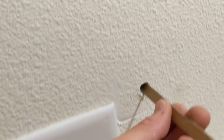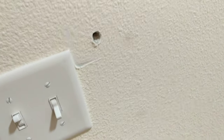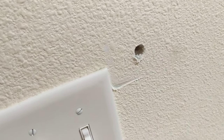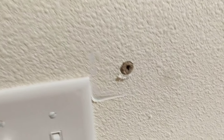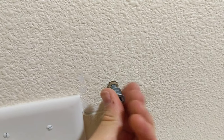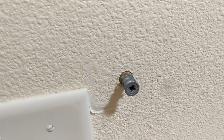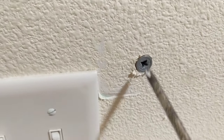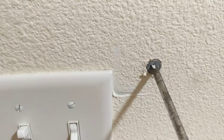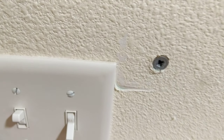So I took a piece of cardboard and measured the distance from the edge of the lip of the hole to the other side of the wall. I'm going to roll up some cardboard really tight and try to screw that in there and see if it holds. I rolled the cardboard up really tight, made it flush with the wall, and took one of these plastic anchors. Hopefully when I screw that in there it'll give it a nice expansion and hold it in place. Let's get that screwed in there. I've not done this before but it seems to be working out really well — I screwed it in nice and tight with the cardboard packed in there.